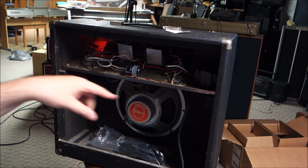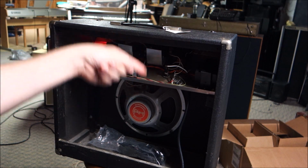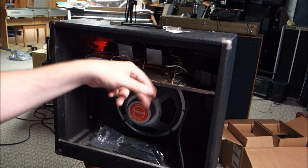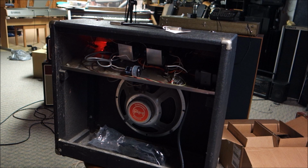So that's the difference. When I had the hot and the common reversed, applying the ground lead would increase the hum, and flipping them this way decreases the hum. So now I'm happy. I do have an earth ground, I do have a quiet amp. Now I can put the back on it, we'll do our little sound demo and call it a victory.